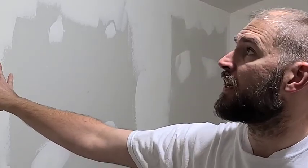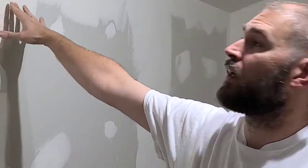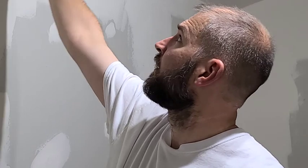All right, everybody. As you can see, I am in the shed once again, and I will be basically sanding it down now. I like the coverage of what I've got with the couple layers of the mud on the walls here. Now I'm just going to go sand specific spots where there's grooves and divots and stuff like that, little hills and valleys of what's really noticeable, like up here.